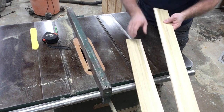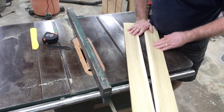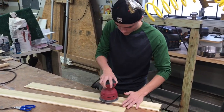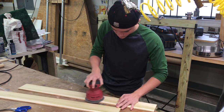To make it just a little bit easier, I took it over to the planer and ran it through one time just to make sure the two pieces were exactly the same thickness. After running it through the planer, it was time for just a little bit of touch-up sanding to make sure it was nice and smooth and looked great.